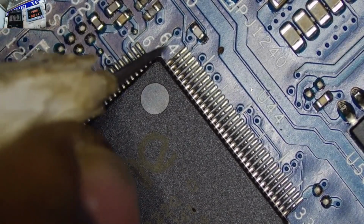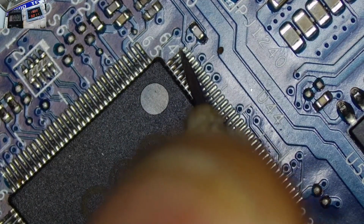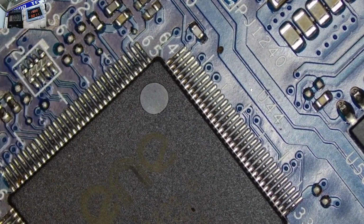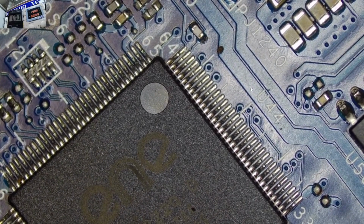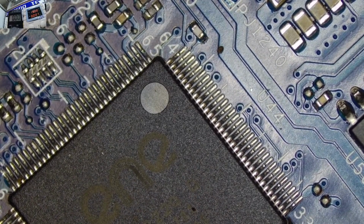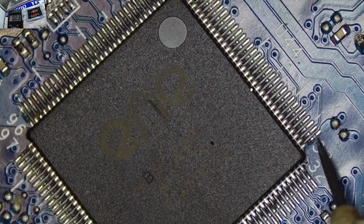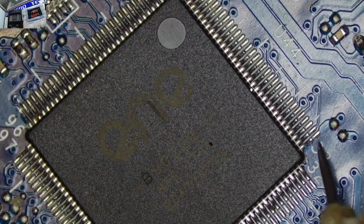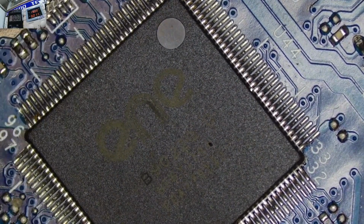This machine is giving us the main power rails that should be present, whether the machine is on or working. As you check my power supply, the machine is not on. The machine is off, but you see, we are still getting these voltages. The 19, the 3 volts. Now we are just about to check the 5 volts power rail, but yeah, you see, 3.3 volts power rail on the startup chip.